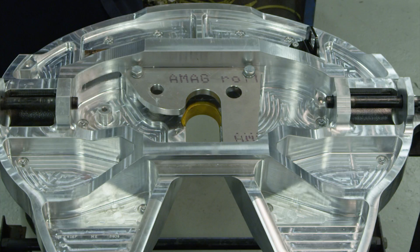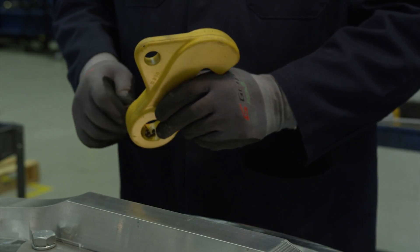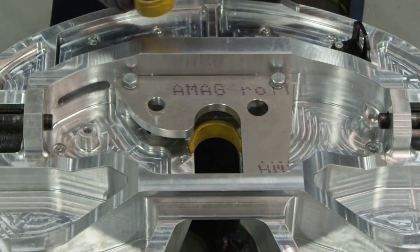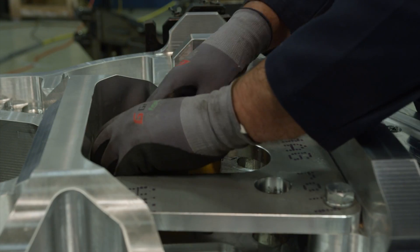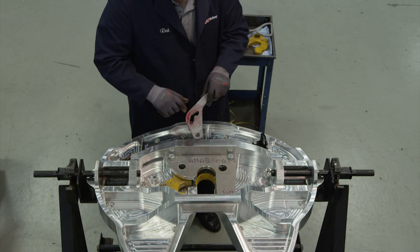With the new lube plates installed, begin the new lock installation. Your rebuild kit contains all components necessary to completely rebuild your 5th wheel top plate — do not reuse old parts. Begin by lubricating both holes of the hook with never-seize, and also lubricate the areas that make contact with the lock with grease. Install the hook pin into the hook's small hole so the rounded head will face the top plate. Maneuver the hook with hook pin into place in the casting. Lubricate both holes of the release cam with never-seize and coat the cam slot with grease.